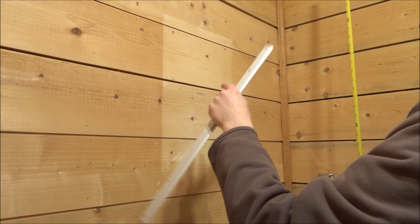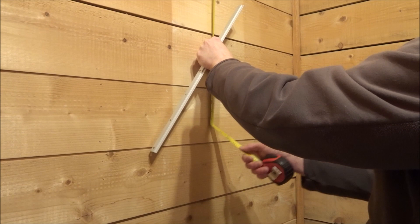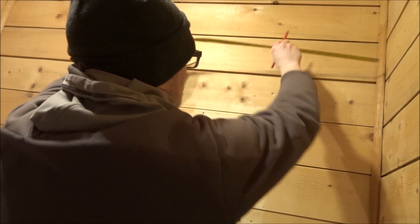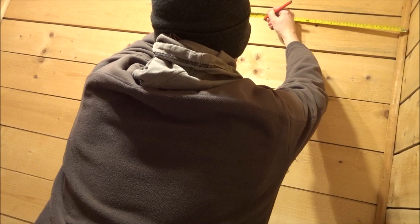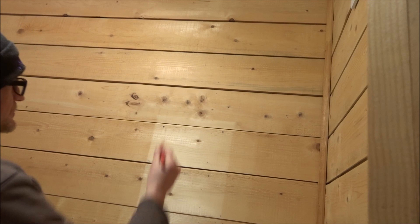As you can see, this is where the old cabinet laid — it's a lot smaller than the one we got from Shopper Plus. The new one we're installing is 26 inches tall, so we want to keep the bottom at roughly the same height because otherwise the door swing will hit the towel rack to my right. So we're going to measure up 26 inches — roughly up at the top of the tape — that's where I'll be installing the hanging bar, once I put a mark and get a level on it. The center of the sink is at 18 inches, which is right approximately there.